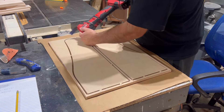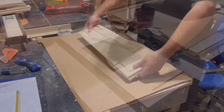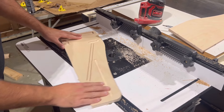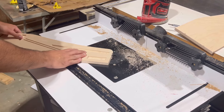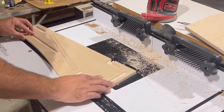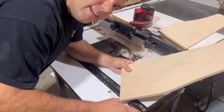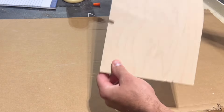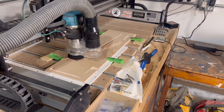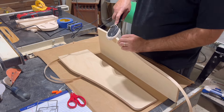You'll notice that the corners of the mortises already have pre-installed dog bones, and that's needed because CNC bits can't carve square inside corners. Having these pre-installed during the machining process will negate the need for any chiseling later on, and allow my square edge tenons to fit in place perfectly. With the side panels off the machine, all I need to do is free them of their tabs using a multi-tool, and then head over to the router table with a flush trim bit to remove them completely. Be careful while using a flush trim bit here, because there is a section on the side panels that is pocketed out past the edge of the panel itself — and right here I made a terrible mistake and plunged the bit into the side.